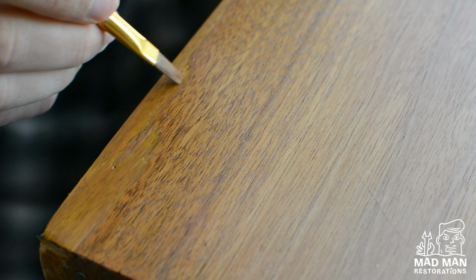After my first base layer of color, I like to use a Mohawk grain pen to put in some faint grain lines. I repeat this process until I am happy with my final result. Remember, it's never going to be perfect, but as long as your eyes are not attracted to the damaged area, it's a win. But I will say my inpainting skills are pretty damn good.